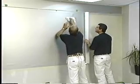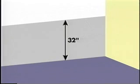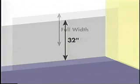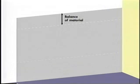Use a plumb line for vertical seams. On most full wall installations, 2 horizontal seams will be necessary. The lowest seam should be approximately 30 to 32 inches above the floor, then a full width run of material, and the last strip at the top will be the balance of material needed to cover the entire wall.